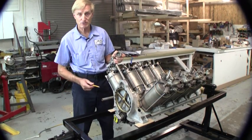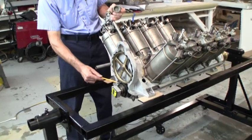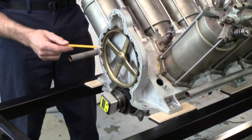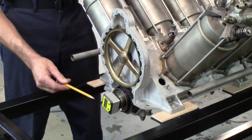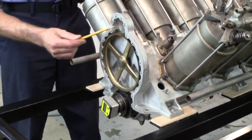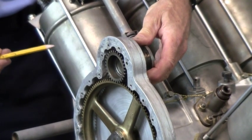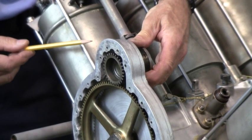To finish off this video on the Curtiss OX5 valve gear, I'm just going to show you the valve gear drive mechanism. Here is the gear on the end of the crankshaft. This crankshaft gear drives the main camshaft gear and they are ratioed so the camshaft turns at half the speed of the crankshaft. This little box here is a digital protractor, which I've been using to set the valve timing and the mesh of these teeth. This hole is where the gear that drives the single magneto goes in. The Curtiss OX5 only has a single magneto, unlike later aircraft engines that have two. We'll be covering the magneto in a later video when we cover the accessories on the engine.